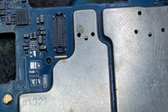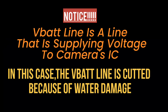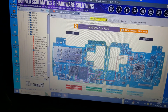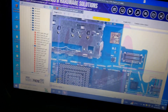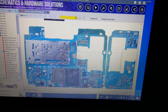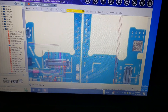As you can see in the video, the VBAT line — the line that supplies voltage from the battery to the camera — is damaged. This IC is not receiving voltage from the battery. The voltage from the battery is always from 3.7 up to 4 volts.